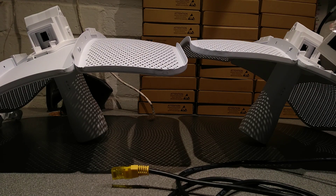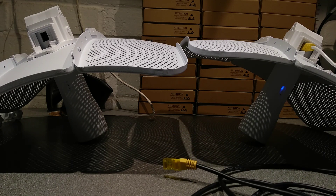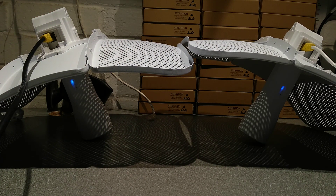I'm going to connect PoE on one of the injectors to the first Pharos and plug it in now. It's lit up — its indicator for power is blue solid, after briefly all of them flashed. Let me plug in the other one as well. As a note, unless you bought these pre-configured, they do not come as a bridged pair. There are some sellers in the UK who sell them pre-configured for about £15 or £20 admin fee each, but these ones are not pre-configured. They're only plugged into the PoE — not plugged into a computer or network yet.